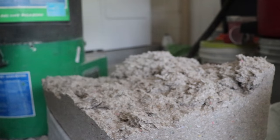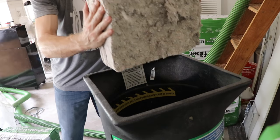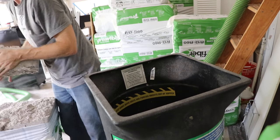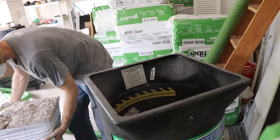You're going to start putting your insulation into the hopper, and you have to break it into pieces as you put it in there. It's packed pretty tightly, so it comes off in chunks that you need to break up. If you don't break them up enough, the blower will get crammed with it — so make sure you do a good job of breaking it into smaller pieces.